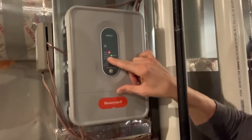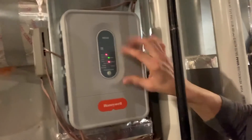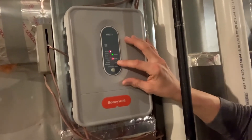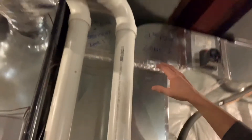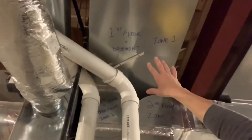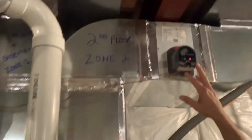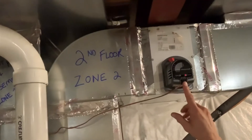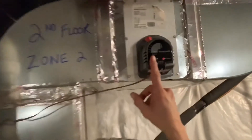When you have it on air conditioning, you're going to see the cool light light up. Now, if you can see here — zone one and zone two — when the system is off, they're both going to be green. Since I'm calling for heat at the first floor, zone one, the ductwork — I've even labeled it for you guys here — is on here. I've got first floor and basement on this ductwork, and there's a zone damper on the other side, an electronic one with a motor in it. Here's the second floor on zone two. Once you turn the thermostat on for the first floor, the second floor damper closes — there's a little motor in it that closes a flap. You can even see this little indicator showing that it's closed, and it even has an LED light showing it's closed. What that does is cut off the air to the second floor, pushing everything to just the first floor.